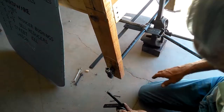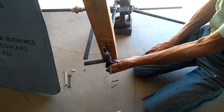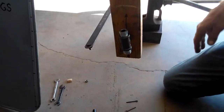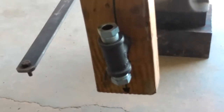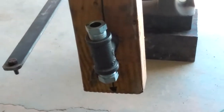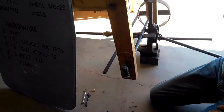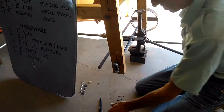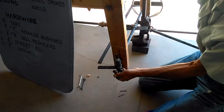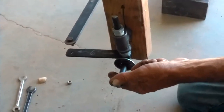The bearings for your front axle are pipe fittings also. They'll be half-inch by quarter-inch reducer bushings, and you'll need to have four of those. You'll want to drill those out to half-inch so your axle will fit up in here like this and swivel. That's your bearing surface.